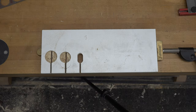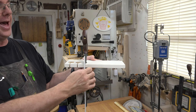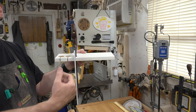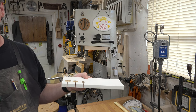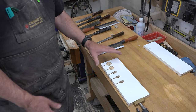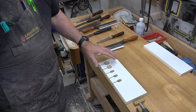When you get that done, you get something that looks like this. Let me show you how the saw fits - instead of sliding in from the front as the other ones do, this one drops down from the top and sits just like that. That keyhole prevents the saw from coming out and supports it. These teeth are facing out, but I intend to keep my guards on them so I'm not reaching in and getting cut. I need to cut a few more like this for my remaining saws of this type. That would be it for the holes for my handsaws. I'm leaving extra space here because there are going to be additions - looks like room for at least another three slots for future consideration.